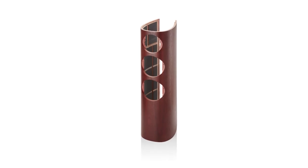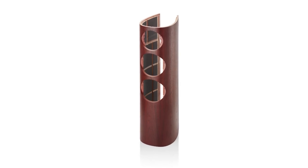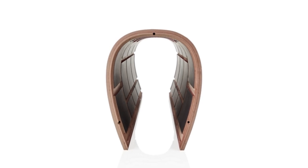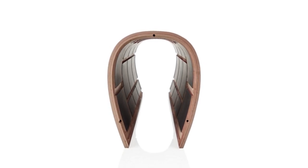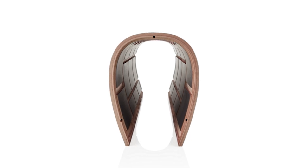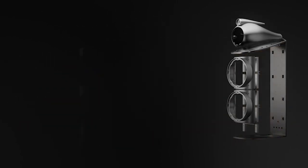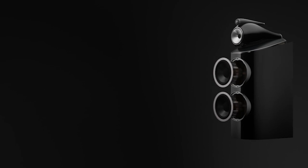The reverse wrap is used on the 801, 802, and 803, but we've also adopted it on the 804 and 805, increasing the inertness of the cabinet and resulting in bigger, better, tighter bass response. We've also made advancements within the matrix bracing — adding aluminum structures throughout the cabinet targeting specific resonances we wanted to eliminate.